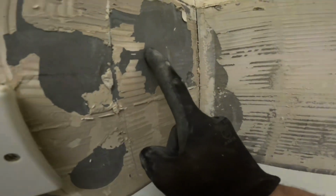So this wall here looks the same as this wall here, but it's not. It's a grey sheeting material, which has led me to believe that this is asbestos. So I'm not going to cut that wood out because it's too close to that asbestos and I could create some dust. I could die. So I'm just going to cut this. Just going to multi-tool the end of the worktop out.